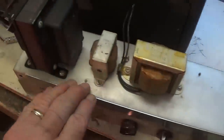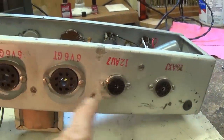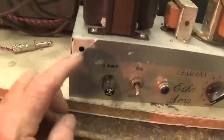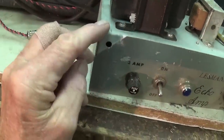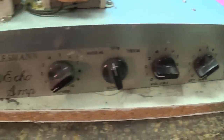The rest of the chassis is nice and clean. Looking at the bottom of the chassis, we see that the tube sockets are clearly marked: 12AX7, 12AU7, the 6V6 output tubes, 12AX7, and a 5Y3 rectifier. We can see that the probably aluminum control panel is laminated onto the surface of the steel chassis, and rather than drill holes through that aluminum panel, they cut the corners off. If anybody can figure out the advantage of that, let me know.